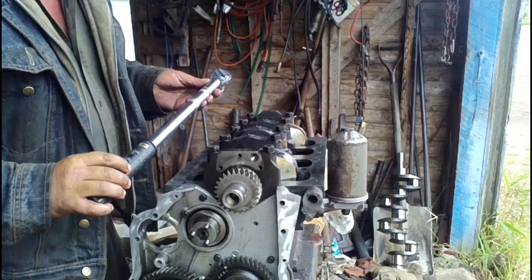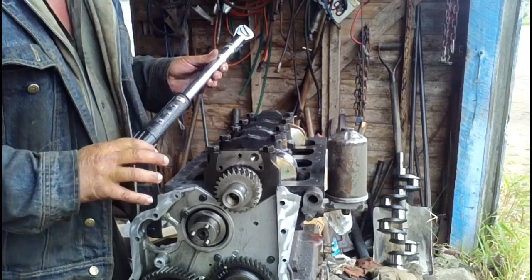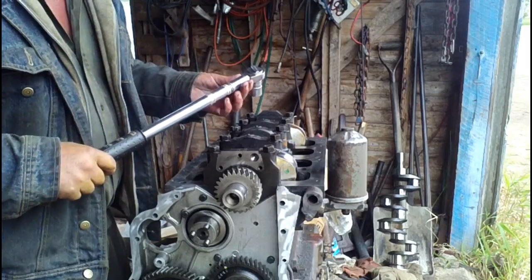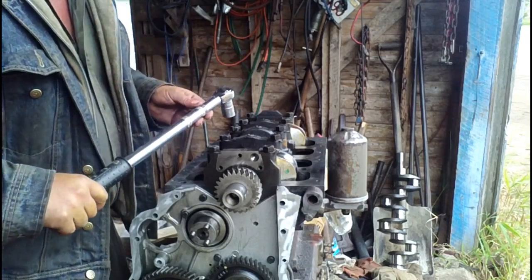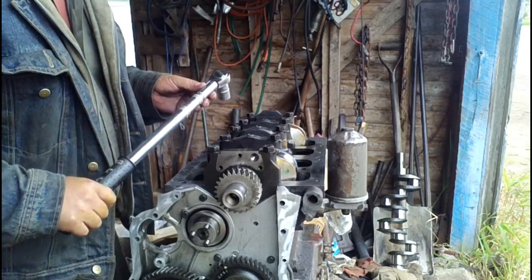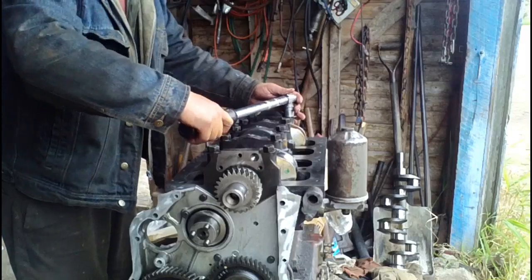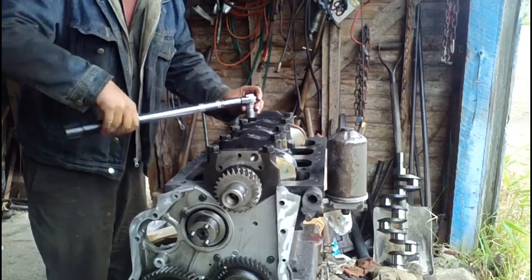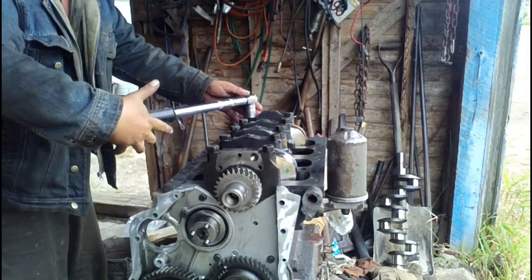I have a micrometer style torque wrench, which works very nice. You don't have to try to hold your hand over a gauge to really gauge. You dial in the specified torque that you're looking for in the little windows here, and when you reach the specified torque, there's a release here. You feel and hear a bit of a click. It's a little harder to feel it at the lower torque settings, so you have to really pay attention when you're at the lower torque settings. It becomes more obvious at the higher settings. So we just carefully, there's the release. There it is there.